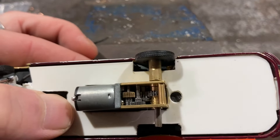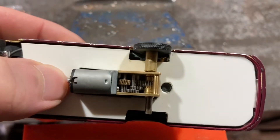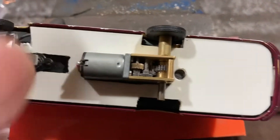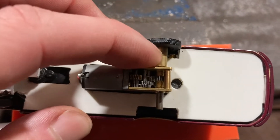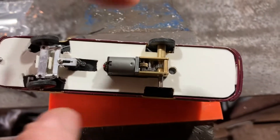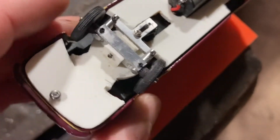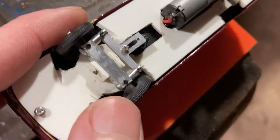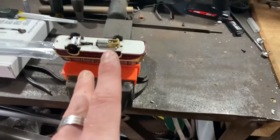I'm relying on a bit of brass tube inside copper tube to hold the wheels on, so I'm going to make a whole new wheel that covers this whole area — a nice tight fit rather than a slightly sloppy fit — to reduce the risk of it bounding along. For the front wheels I'm making a new set as well because I really don't like the plastic ones. They keep rubbing and they're a little bit wibbly wobbly because the holes are a different size to the pins.